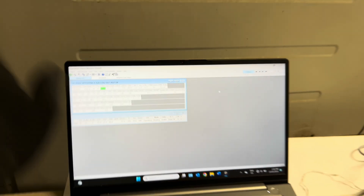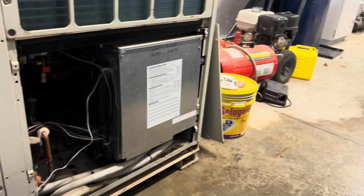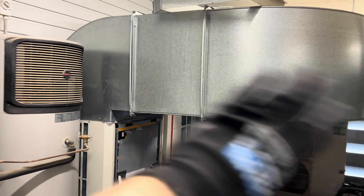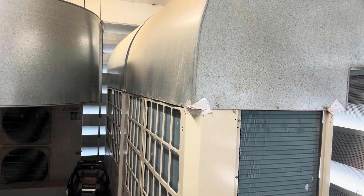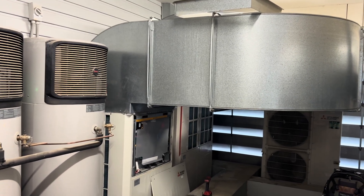We've been monitoring this one for about an hour — the fan is not dropping below 100 percent, working its ass off. Then it just turned off — satisfied. As it stands, I've spoken to the office. We'll have to replace that fan, sort something out with the ductwork — potentially run it through the roof. Once that's done we can come back and set the static pressures properly. As it stands, they're going to start losing fan motors left right and centre. The compressor was rammed up as well — there are a few issues here.